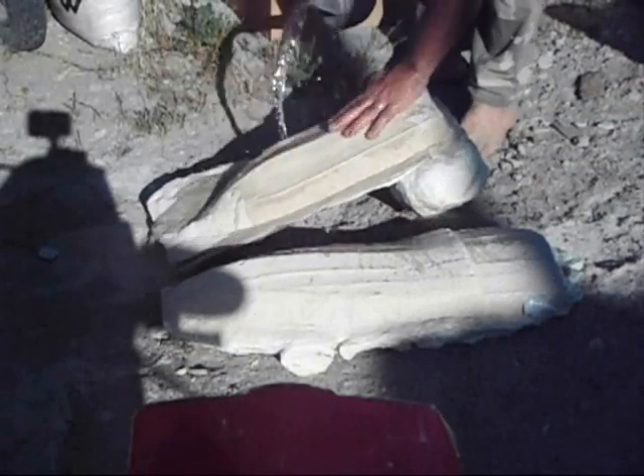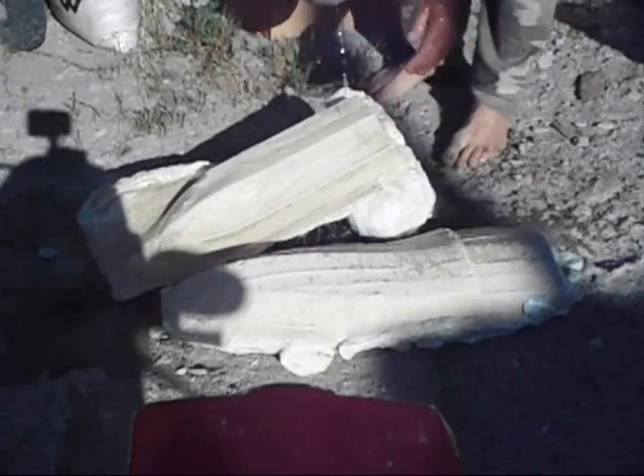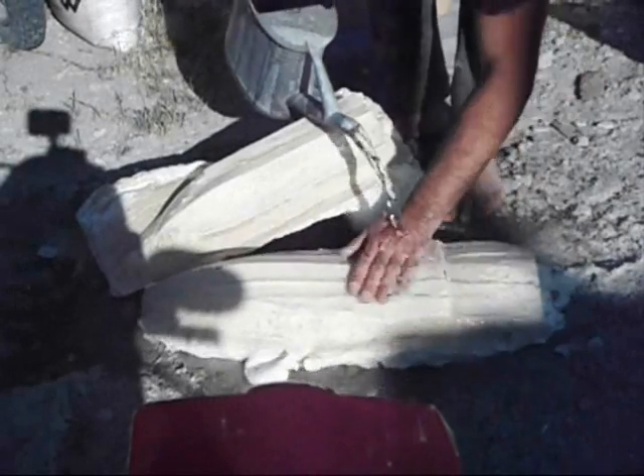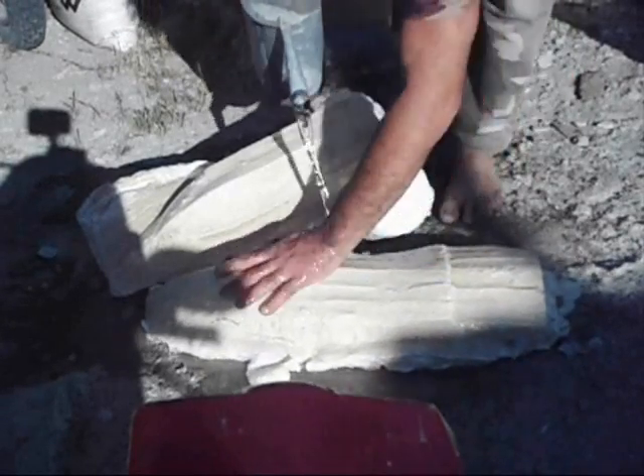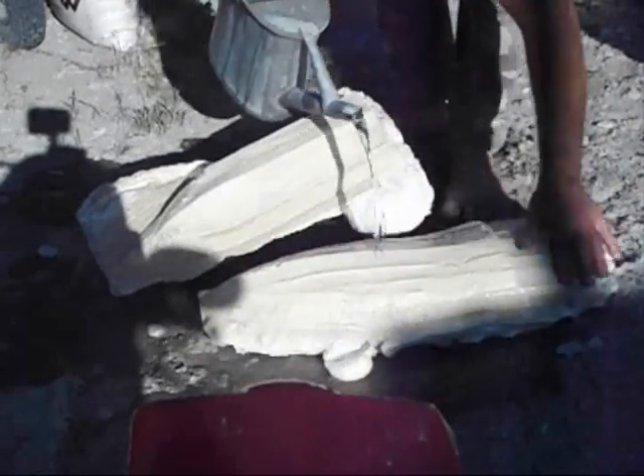One problem with this foam however is that the boats come out quite wobbly, quite floppy. If you were going to do this and use the hull you would want to probably put some sort of carbon fibre or maybe aluminium rod in the mould just to make it longitudinally stiffer than it is.